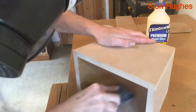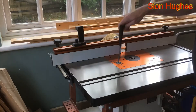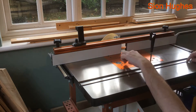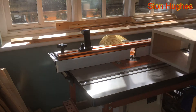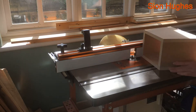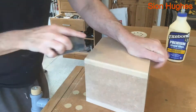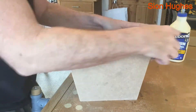Back to the orbital sander with the 220, and the hand sander is a 320 — very fine grade. I decided the top of this stand was going to have a round-over on it, but not the bottom, because if I rounded the bottom over it would act as a dust trap. So I'm only doing the top, and of course at a funny angle you can only do the edges that are accessible. The top is accessible and is still 90 degrees. Back to the 320.